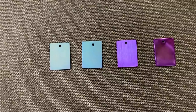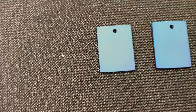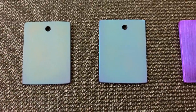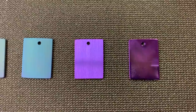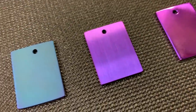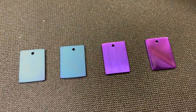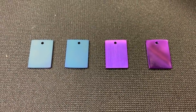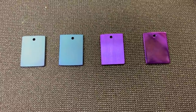This one's fun. All four pieces were done at 85 volts for the same amount of time, all at the same time. You can see that the blasted and tumbled are blue, almost bordering on green. The tumbled finish is a nice color, and then we get into the satin and the polished and we see that they are blue-purple — blurple. This is a very good demonstration of why we never call out colors just in terms of voltage, because there's a lot of discrepancy that can happen at the same voltage.